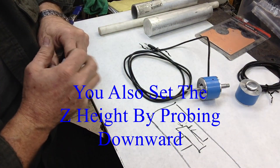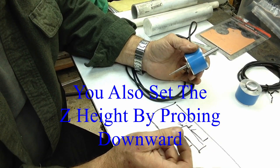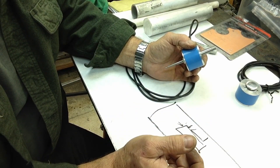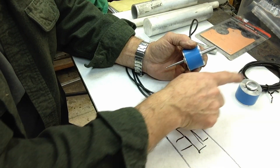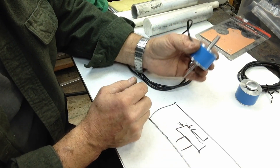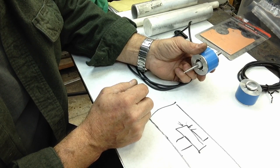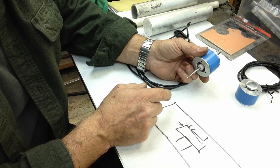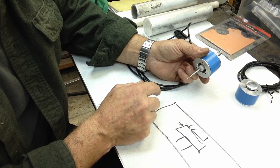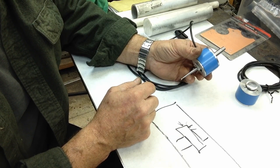They're really useful - there are other uses for them in the shop. If you've got them on your CNC machines you can run fully automated probing programs, so your mill can automatically stop the spindle, move over the top of a touch pad, and touch off to give you your tool height or check for a broken tool for unattended machining. On the lathe, I plan to use it on my CNC lathe to set zero for where the end of the stock is when I advance stock to begin my cut.